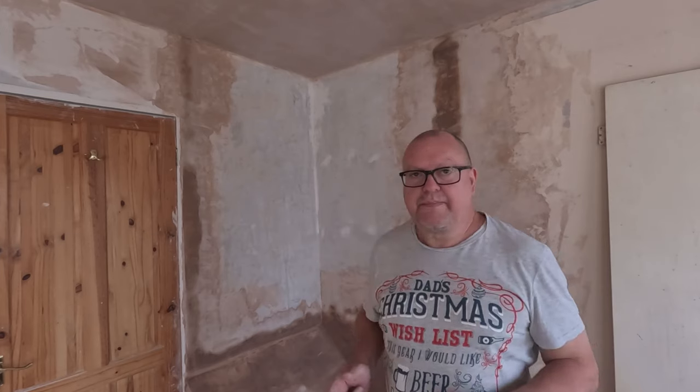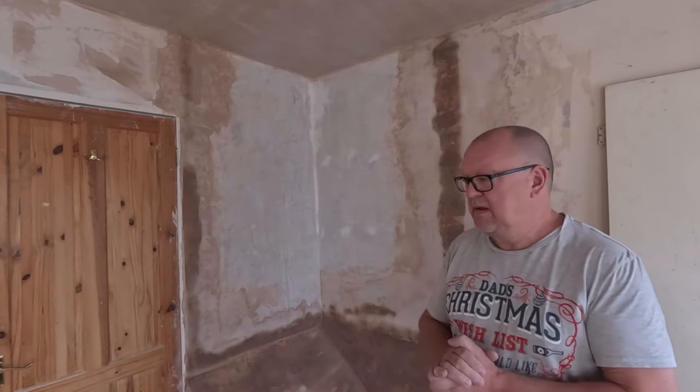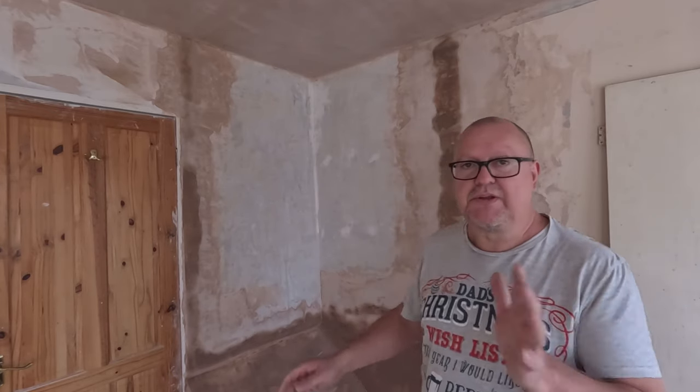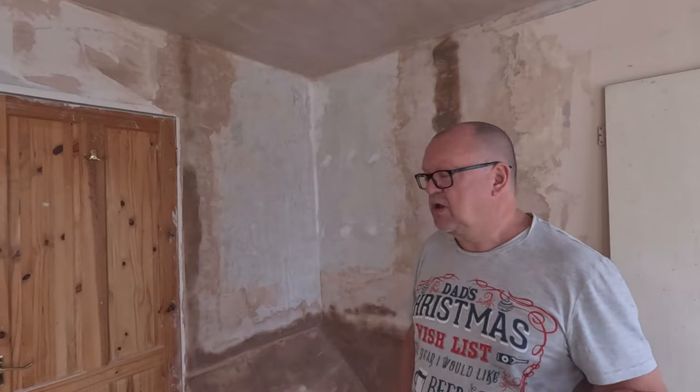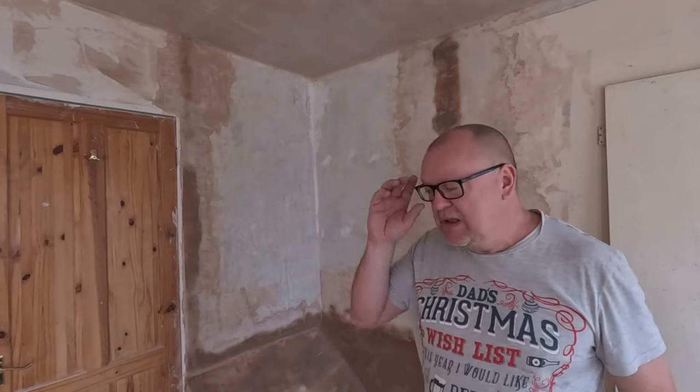Up early in the morning, skirting's been delivered. The plaster's drying out okay. Needs a little bit of feathering with the sander. What I've done now, I'm getting a bit fed up of taping the door shut. The door's a bit bulged, it's old and going to be replaced. So I'll put a screw through the door so it's nice and solid back, to stop any dust.